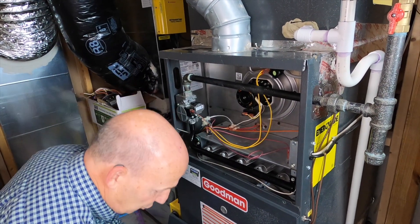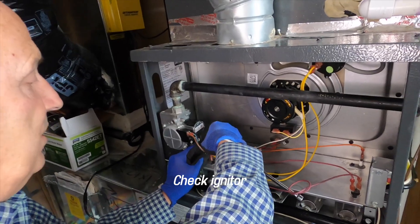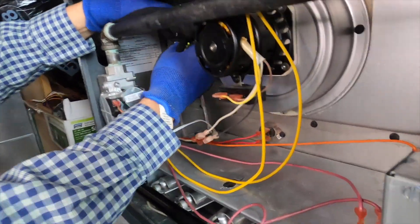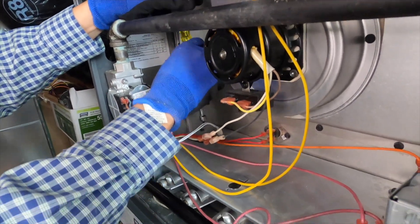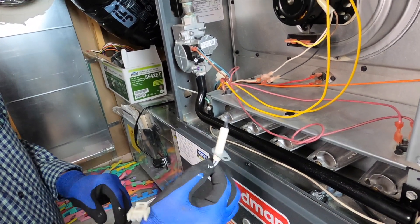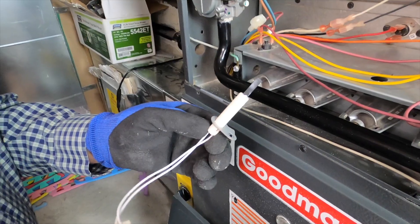Many times a washer and dryer — things like that — it's a very dusty, linty kind of place. We're going to look at the igniter here. We just simply have a little Molex plug-in. We take our 5/16 nut driver — just one screw. This is our silicon nitride igniter. These are extremely good igniters.